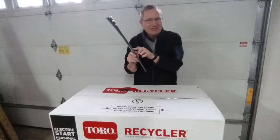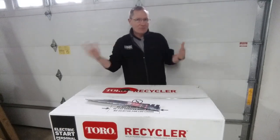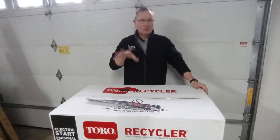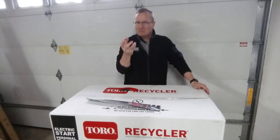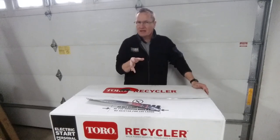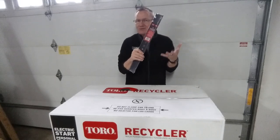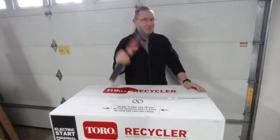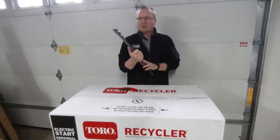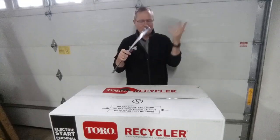This is maybe a half-inch hole here, where a lot of lawnmowers — such as some of the old Lawn-Boys and Toro riders I've worked with over the years — have a much larger spindle holding the blade. The knock-off ones have that larger spindle hole and use shims or washers to reduce it down. But if you lose that knock-out piece, the blade becomes somewhat useless. So I spent the extra two dollars and got the Toro one, which has a little edge for blowing out and chopping up clippings.